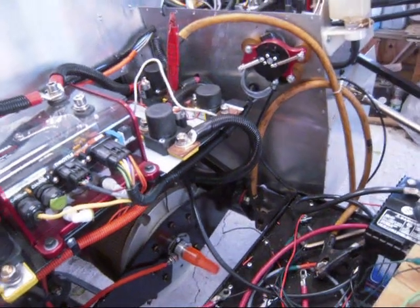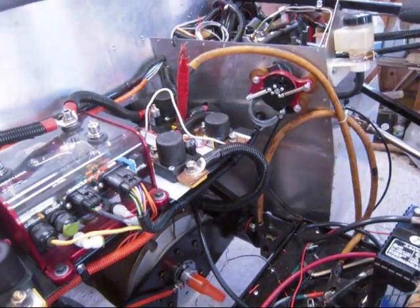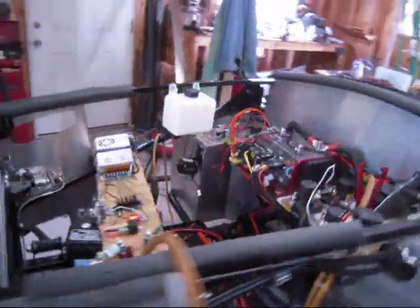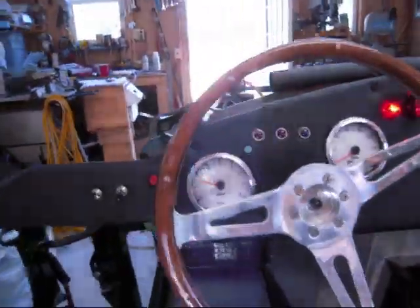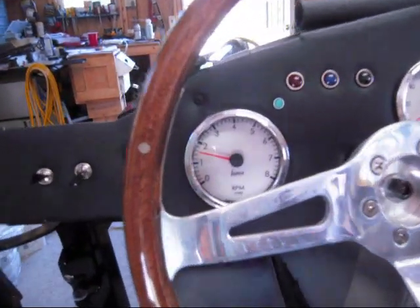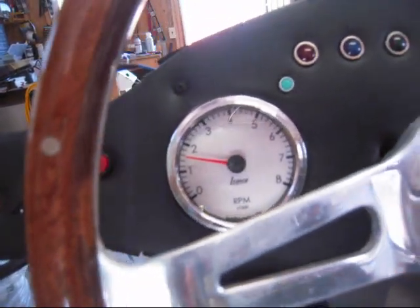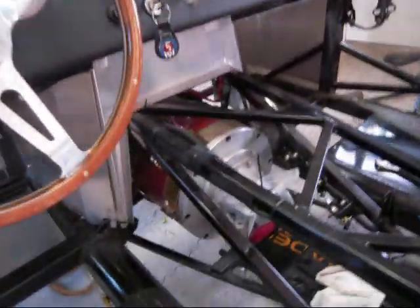The plan is to run the motor for about 12 hours on 12 volts to help finish breaking the brushes in. With the power turned on, we can see we're running about 1600 RPMs or so, which is just on 12 volts with no load whatsoever.